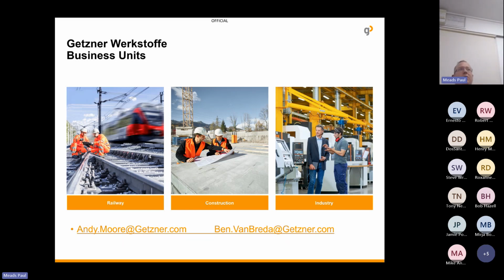Yeah. I know that certainly composites are replacing timber, the wooden sleepers, in Network Rail, and the lateral track resistance tests you've seen from Southampton, they're now going to test composites with their pad to see what the lateral track resistance is for that. But yeah, presumably that's glued on. Yeah. That introduces another element, doesn't it? Yeah, the shear force between the pad and the sleeper. Yeah.